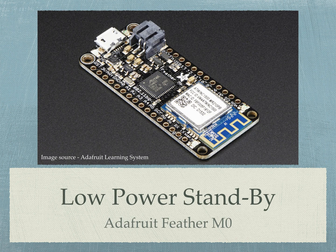In my garden, the deer don't come around very often, so the MammalCam needs to run for days waiting for a chance to take a picture. To do that, it saves as much power as it can. The Feather M0 with the Atwinc 1500 Wi-Fi module consumes about 12 milliamps when deep sleeping and around 35 milliamps when it's awake. The PIR adds another 10 milliamps. With 6,600 milliamp batteries, this project can sleep for about 12 days. When it wakes up, the camera consumes as much as 200 milliamps when its lights are on, so the total time between recharges will vary depending on how many pictures are taken. The low-power design saves a lot of energy — the battery would only last about a day if the Feather and camera were always on.